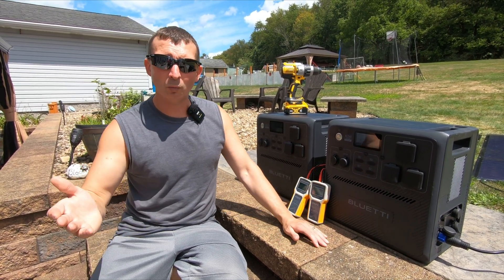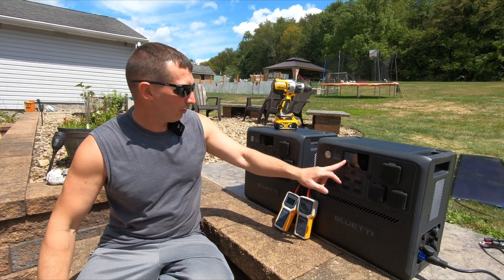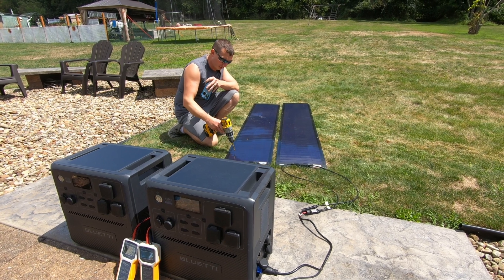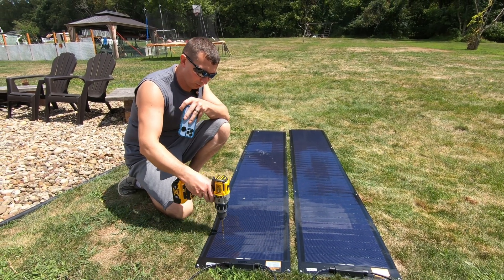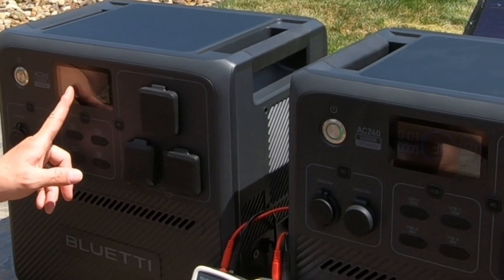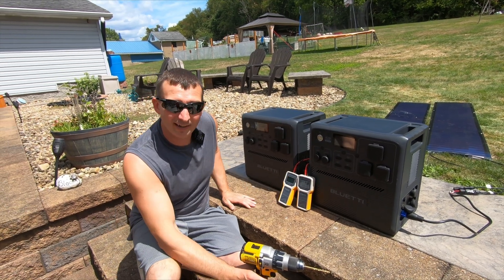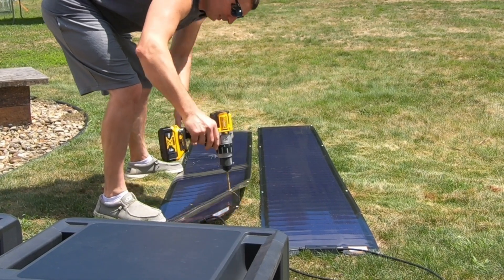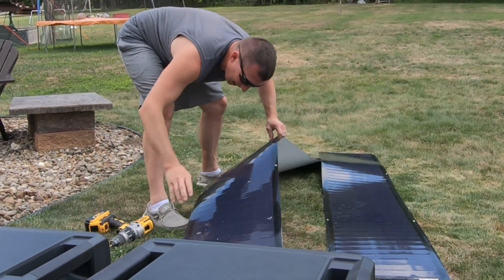With the sun back out we got 100 watts on the right one and 94 watts on the left — about a five watt difference. Now I'm going to pick where I drill this next hole — right in one of the seams to see if that affects two cells. Still only a five watt difference after that. Let's keep drilling — three holes now, let's drill two more quickly. Let me get the grass off so it doesn't affect the reading. Now we've got one, two, three, four, five, six, seven holes total.